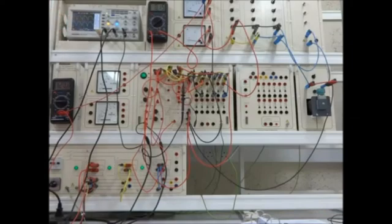We're talking about phase voltages here, by the way, so we've got nearly 150 volts peak, or around about 150 volts peak. If you work that out, you should know that peak voltage is √2 times the RMS voltage, and I said we had an RMS phase voltage of about 110 volts, so that seems approximately correct.